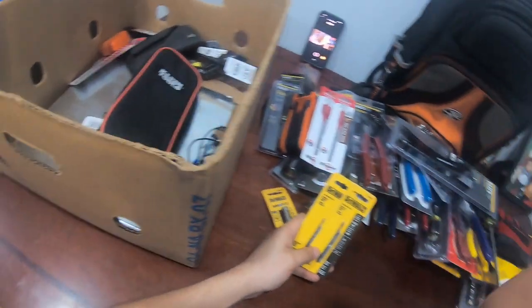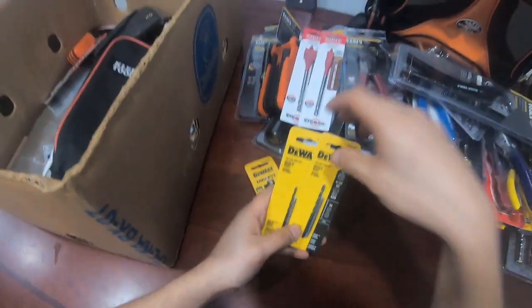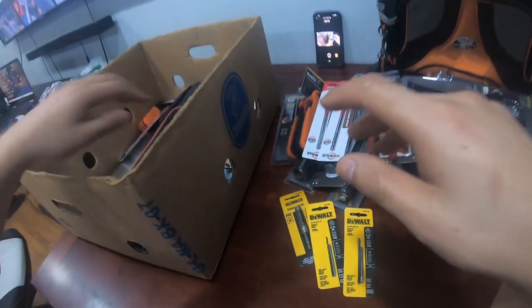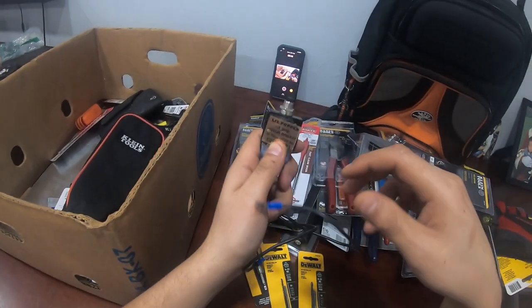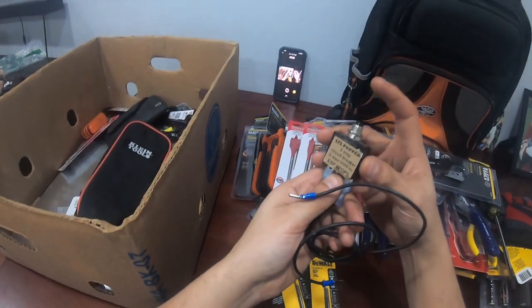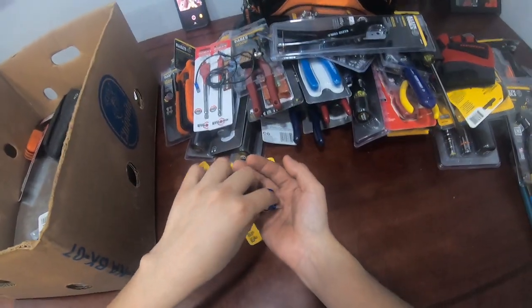For example, old electrical pancake boxes have no holes to accept light fixtures. So I'll drill a hole, tap it, then insert a screw and hold the light fixture up. I really don't like dealing with old electrical honestly. I also have a little popper for HVAC — when you have a short circuit, instead of blowing fuses all the time, this popper saves your fuses. I use it while troubleshooting a short, and once I find and fix it, I don't really need it anymore.